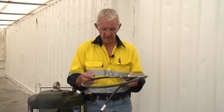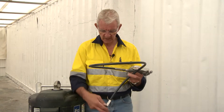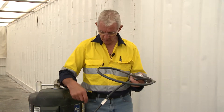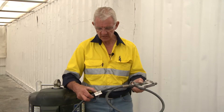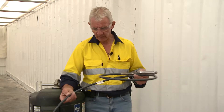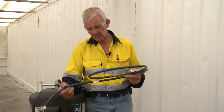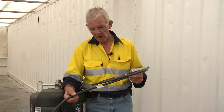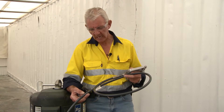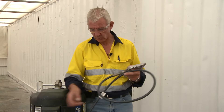The airless gun is attached by a section of hose. The airless hose has two aspects: it has a pressure rating indicative to the capacity of the pump. In this case, because it's a 6,000 psi pump, we're looking at 7,600 psi maximum burst pressure — because if we use something with a lower pressure rating, it would be dangerous. These hoses are wire braid. You cannot use a rayon braid for this type of airless pump, because they don't have the wall thickness or wall capacity to harness all of that pressure.